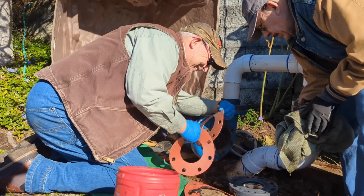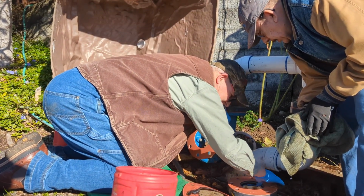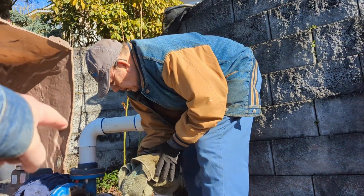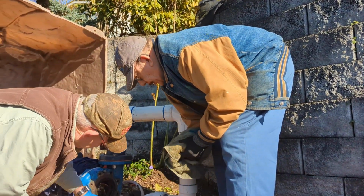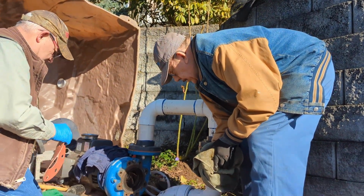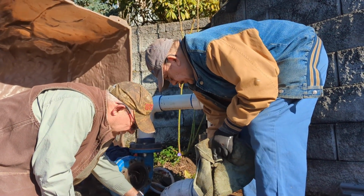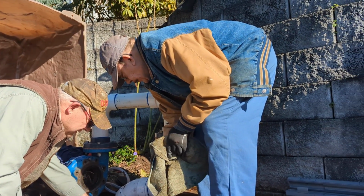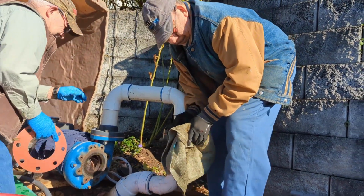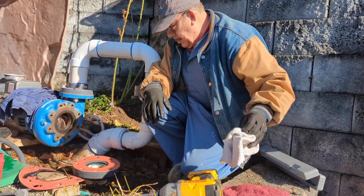If you go to the store, they sell plumbing grease. And I use it religiously because you've got one little hole there on the gasket that isn't punched out. You see it? I use it, for example, when I put a nozzle on a hose or hook the hose up to the house, because then a year later it just comes right off. So I've become a fan of plumbing grease. Well, it's good to know.